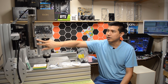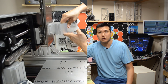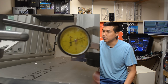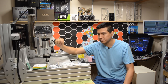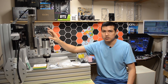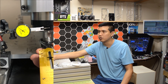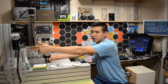One thing I did have to change from my previous video is that this part on the Z-axis was mounted differently. The main reason I changed it is because first I had play of around three thousandths of an inch, and when I hit the spindle you could hear the back of the Z-axis resonate, which gives a horrible finish. Switching the Z-axis this other way makes the spindle a lot more solid — the play I measured was about one and a half to two thousandths of an inch, a little less than before. The only downside is I lost about one and a half inches of clearance.